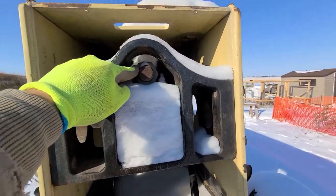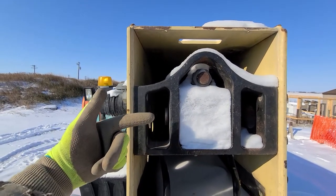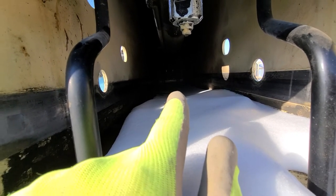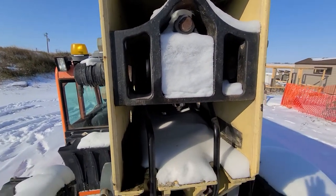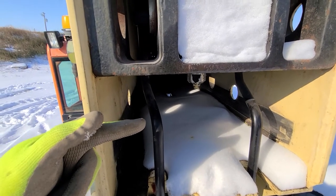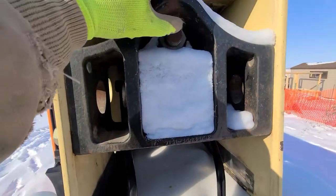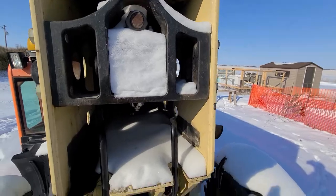You can get it out by removing the whole carriage assembly, which means taking apart the rod that attaches to the chain. That chain goes around the bogey wheel on the front of the boom and then comes back and attaches — actually goes around that bogey wheel and then back to the front. You'll have to pull this apart, and when you disassemble the chain from where it's pinned in the carriage, you can pull that pin off the carriage, then pull the rod out with the chain attached, and that'll allow you to slide the whole assembly out.